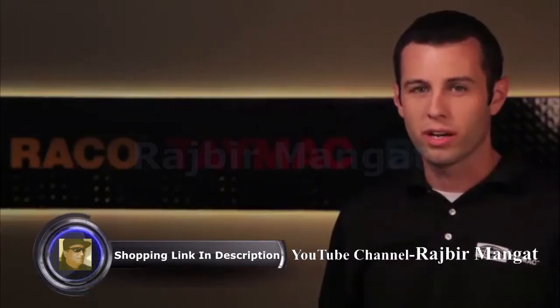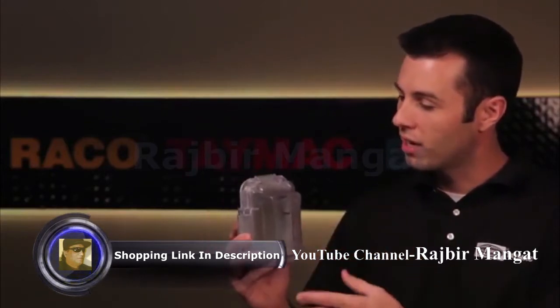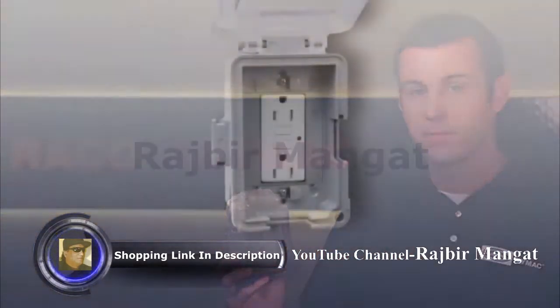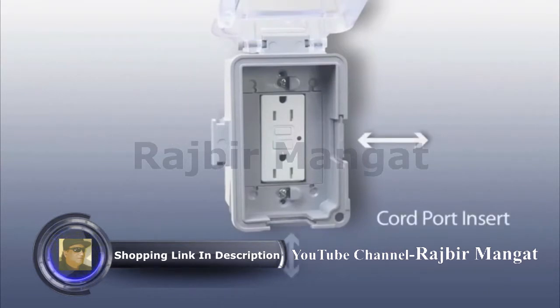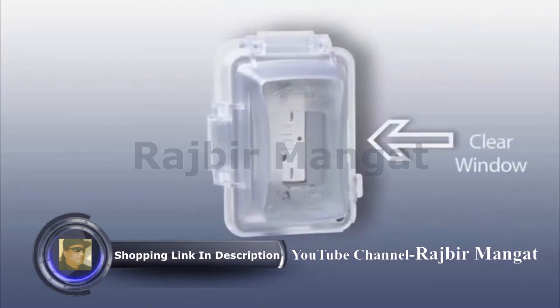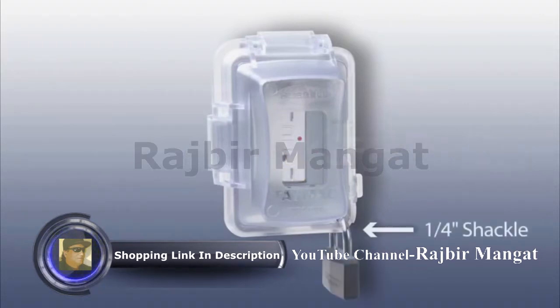First generation bubble covers weren't rugged enough to meet the extra duty rating, so the MM420 was completely redesigned to meet the extra duty requirements. We've also added enhancements like the patented Easy Change Pin, which allows for easily switching the cover to a horizontal mount, a reusable cord port insert so the port can be closed to keep out elements or insects, a clear window for easy visual inspection of the inside for bugs, an unplugged cord, or a tripped GFCI, and a larger locking latch that now fits a full-size padlock.